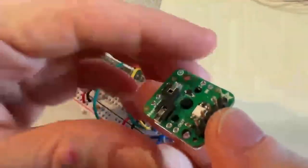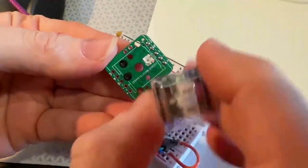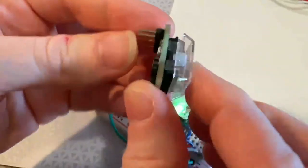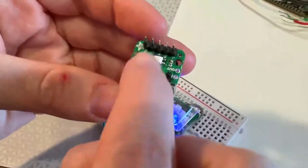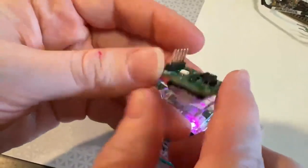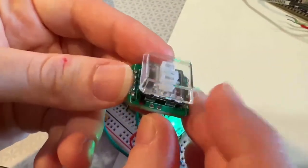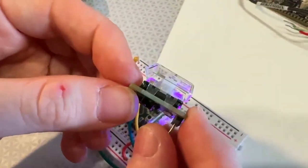This one has a NeoPixel that goes through. Let me show it. It's got a socket so you can connect either linear or clicky style. There's that glow-through NeoPixel. And then you get keycaps as well. And then we've got a diode so you can matrix these, and breakouts all over the place so you can breadboard these very easily. So an update to our existing MX compatible Neo Key. This is the Neo Key Choc.